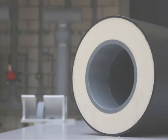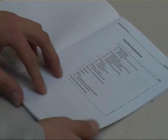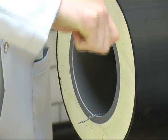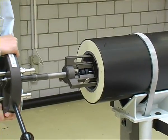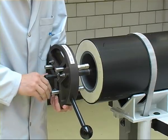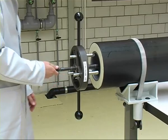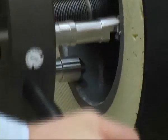CoolFit pipes of D140 diameter and larger must be calibrated on the inside to ensure that a proper joint can be made using a double nipple. Georg Fischer developed a special pipe calibration tool for this purpose — please refer to the enclosed detailed handbook. First, chamfer the inside of the pipe to facilitate the beginning of the calibration cut. After assembly of the correct jaws and cutting head spindle for the pipe diameter, introduce the calibration tool into the pipe parallel to the pipe axis up to the identification mark. Lightly lift the head of the tool to ensure good alignment, then tighten the jaws with the spring handle. The cutting head is now wound evenly using both hands until flush with the end of the pipe, during which material is removed from the inside of the pipe.